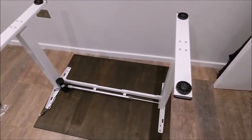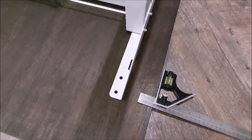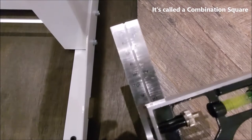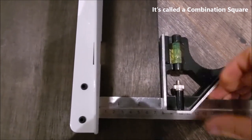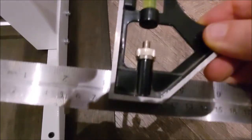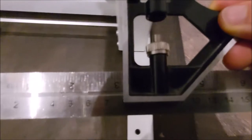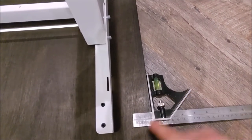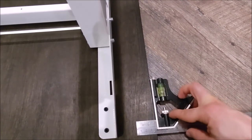To find the centre position, I've pushed the frame to one side so it's flush with the edge. Using this tool — I believe it's called a carpenter's square — you rest it alongside the frame. We can see it's almost 8 centimetres. So we basically half it, which works out to about 3.9 centimetres. Then we push the frame back until it meets that mark, and then we know it's centred.